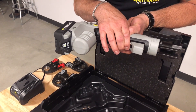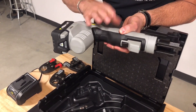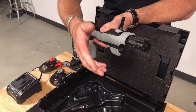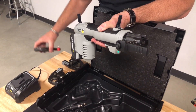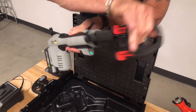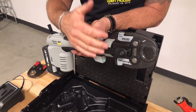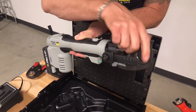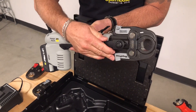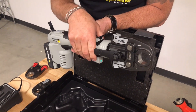One button is the actual actuator that runs the tool, and the other is a RAM release. Should you cycle the RAM inadvertently and can't open the jaw, you can release the RAM. It's very simple to install a jaw on the tool by releasing the jaw pin mechanism. We can press up to inch-and-a-half PureFlow PEX, up to inch-and-a-quarter copper tube size fittings on the ProPress line — including copper and ProPress stainless systems — as well as Megapress up to three-quarter inch, covering all Megapress fittings in the iron pipe size system from half-inch to three-quarter.